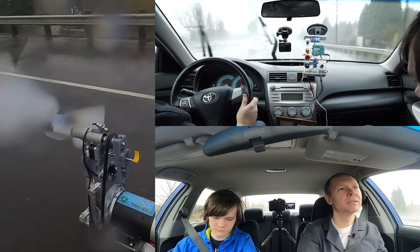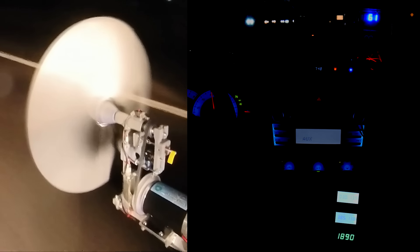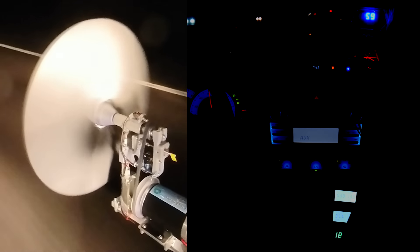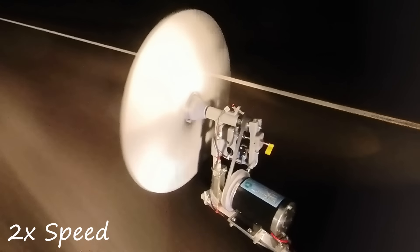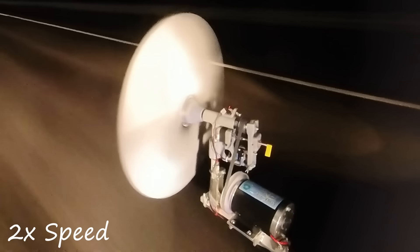It's so hard for me to believe, but we're heading out again that night to give it another try, being very disciplined about when and how much we adjust the pitch. It seems to be working better — decreasing pitch as we watch RPM and power increase. Again, we get over 200 watts with the turbine at just over 3,000 RPM. But shortly after, the power drops off and we can't tell why. As you can see from the footage, it's because the turbine mast is twisting in its mount.